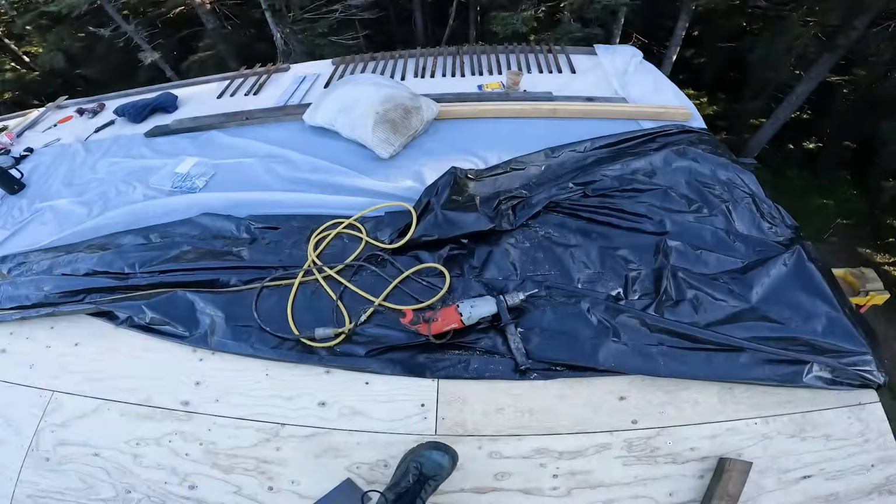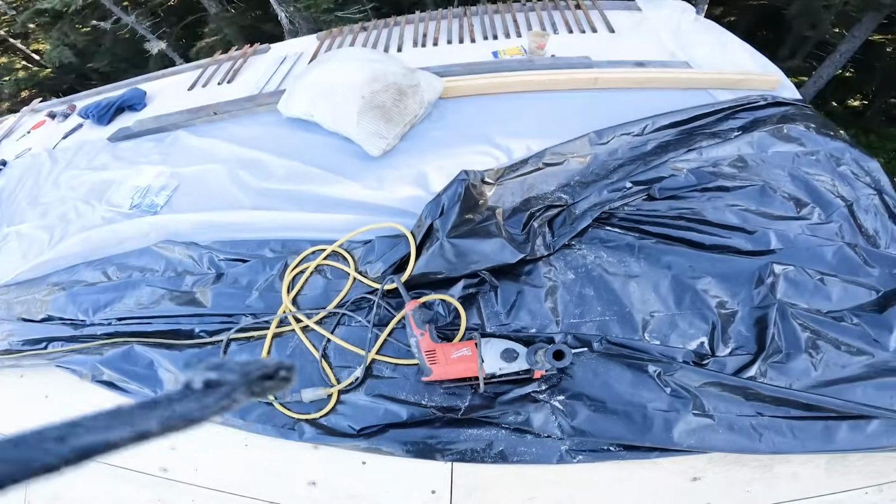Go over here, so hopefully you guys can hear me super loud, the impact driver. Anyways, we tried to use the drill, this drill, to drill the screws into the tubes, and it didn't work. It just didn't have enough torque, and we kept stripping all the heads because it's really tough to do it. So anyways, Vian, a suggestion from Mr. T: nail the screws in the wood before we drive them in, and what a difference, like night and day.